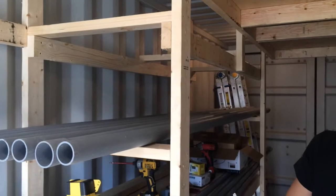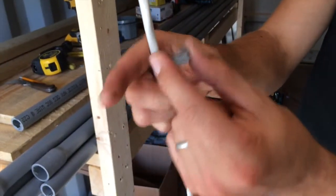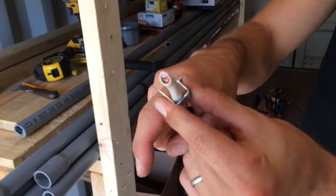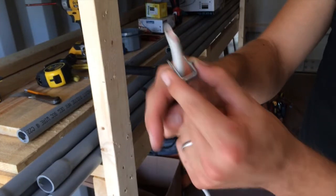So we use our S2 staples. If you use the S1, it's way too tight and you'll get a deficiency — you'll also compress the wire too hard and it'll actually pinch it. So that could build up resistance, a heat spot, or even cut the wire.